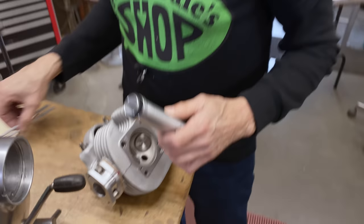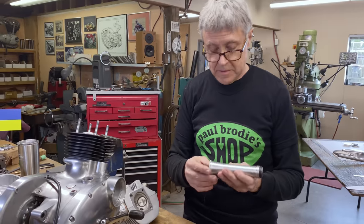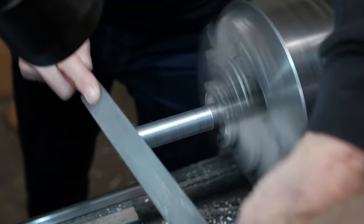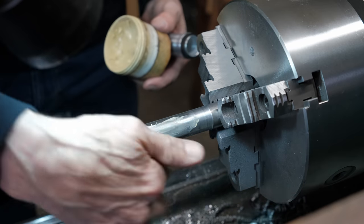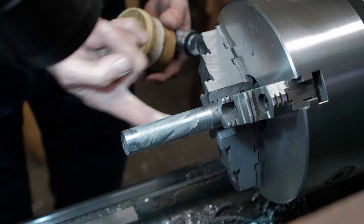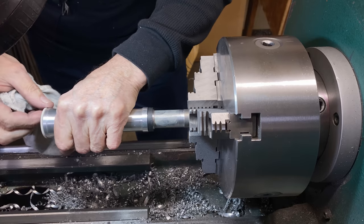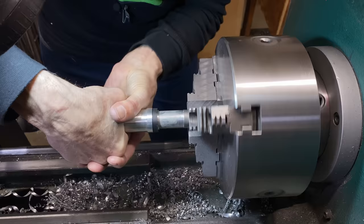Okay Mitch, we have to go back to the lathe. Maybe what I need is an arbor — make up an arbor, how long can that take? I've got a little bit of grease here because aluminum likes to seize onto a steel shaft, so it'd be a real shame to put it on there and then not be able to get it out because it galled. I didn't anticipate this — oh well, it's just what happens when you make stuff. Things don't always work out.